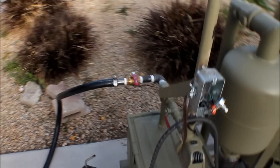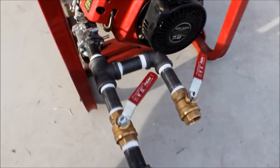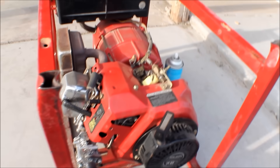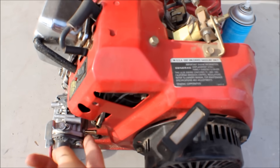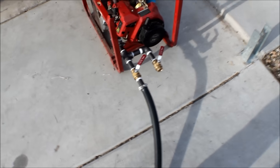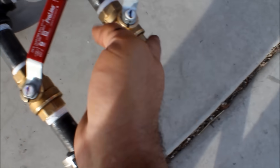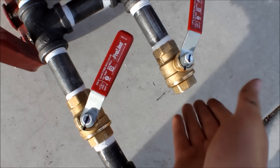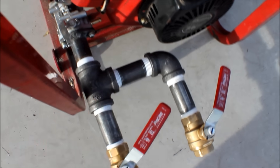Once it's ready I can turn on this valve, which goes over to a manifold that I bolted right up to my carburetor on my generator. There's absolutely no gas tank on this generator right now — you can see where the gas line usually connects, but it's completely gone. I drained the float bowl so I know there's absolutely no gas in there. I have the ports marked exactly — this is the fresh air and this is the vapor. You do need to control the air to fuel ratio here because the jets aren't doing that the way they were designed for.